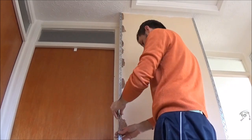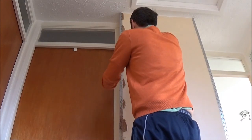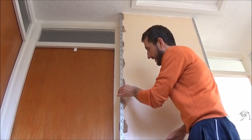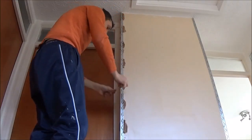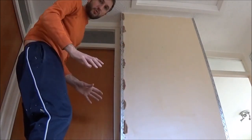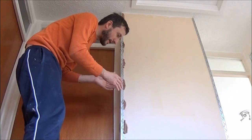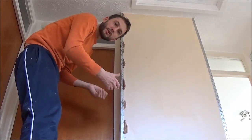Place your plaster bead against the wall and offer it up into position. Working gently, you can see I'm just squeezing that in and all the plaster will start to squeeze through the bead and hold it into place. What's nice about this method is that you don't need any fixings — so if you've got a masonry wall you've got no problem at all, and it also means you avoid the issue with nails and screws that sometimes pull the metal in. By using this method it'll line itself up in a nice straight line. It's only about 20 to 30 minutes to go off and you could do something else while that's drying anyway.